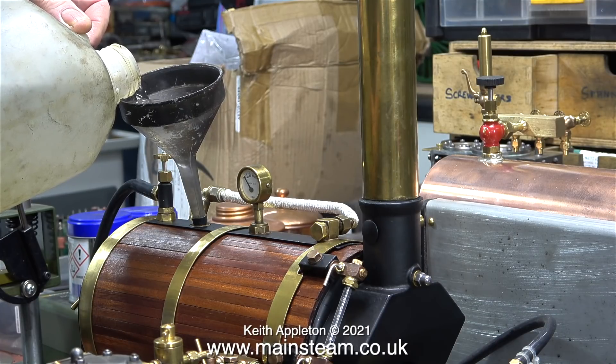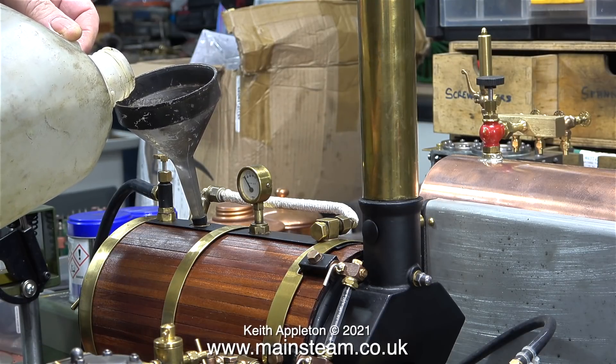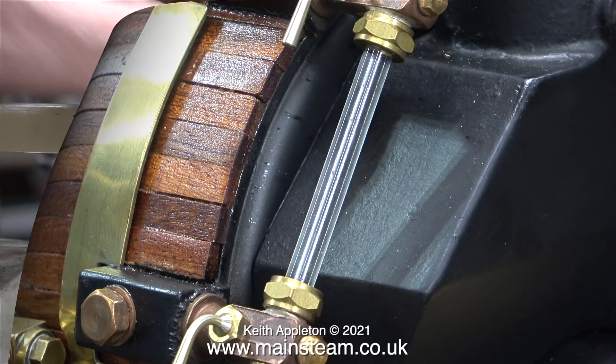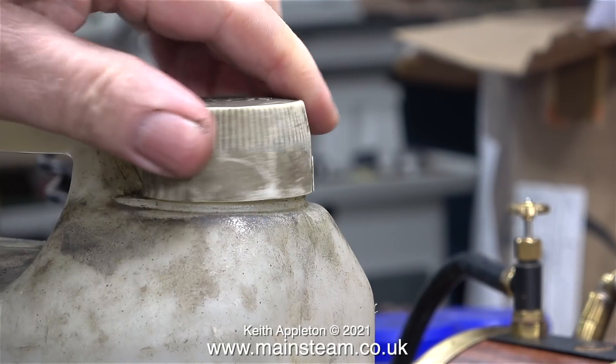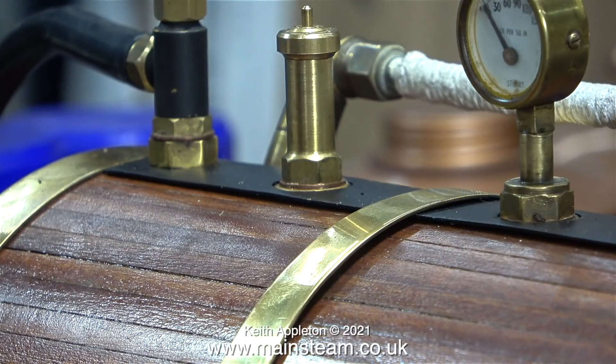When filling a boiler this way you have to be patient, but not quite as patient as when filling it with a hand pump, which takes a long time. I filled the boiler right to the top of the water gauge. The only trouble is a full water gauge looks very much like an empty one, but trust me — it's definitely full of water. After refitting the cap on top of the water bottle, I refitted the safety valve into the bush on top of the boiler.